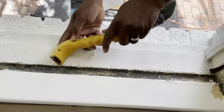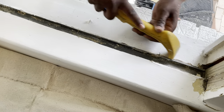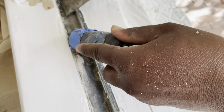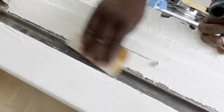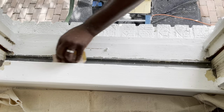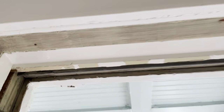I leave the bottom sill in place, and same thing at the top — it doesn't need to be removed. It has a lot of nails, so I mostly come through with a scraper. Here I'm using a pro scraper, which cleans off the big gunky parts of paint, and then I chip it off with a little chisel — whatever tools you need to get the paint off so you can have smooth operation of the sash when it's all done. I then sand everything with 120-grit sandpaper to really clean it up. Same thing on the top of the jamb: sand it, scrape it, whatever you need. You don't need to remove it — it's lined up properly, so let's keep it in place.